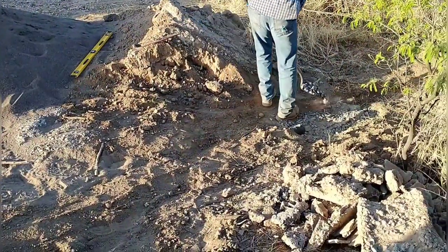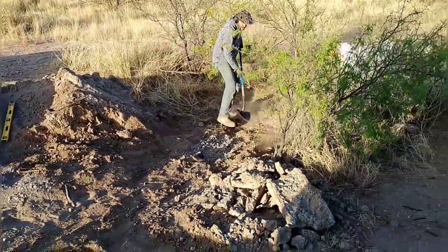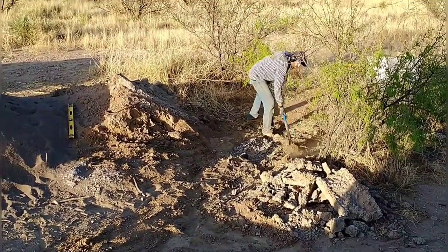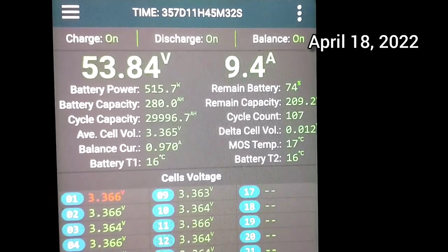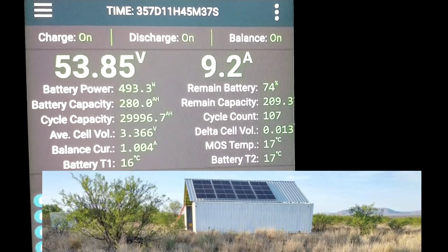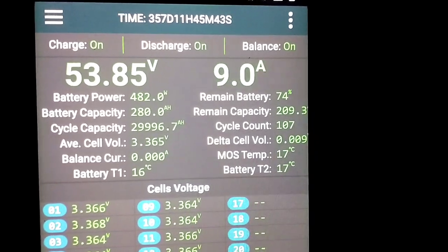At the exit of the drain line I built a trough of gravel and concrete — a couple of trough-shaped concrete pieces along with gravel to create a chute that slows the water and keeps it from eroding the area. We've been here about a year now, and I checked the cycle count on our batteries — we're at 107 cycles. Most of that happened through winter, averaging about one cycle every three days, which isn't bad at all.